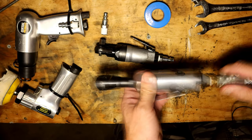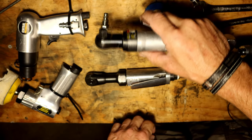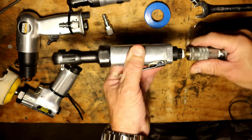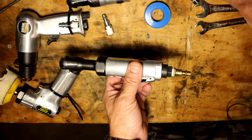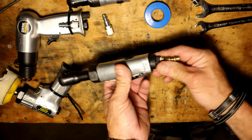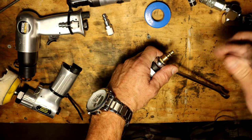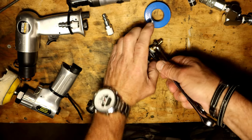That's a recreation — I put debris in that screen and that's what it sounds like. Here's what it sounds like when it's clear: real fast, real peppy, no problem. Obviously I've got more than enough air for the tool, but when the screen is clogged you get that sluggish sound. That problem took me a long time to figure out because I didn't know about that screen. Let's take it apart, show you how I gummed it up, and blow it out.